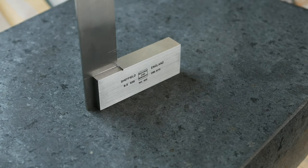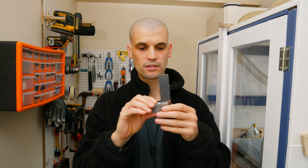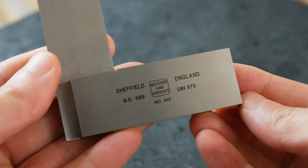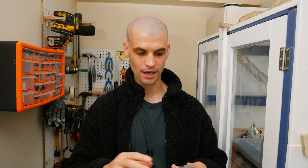Another useful item is an engineer square — a three-inch one. You do not need anything larger. All you're really checking is squareness, which just uses this little corner, and you can also use it as a reference edge to square stock in your vice. This is a Moore & Wright, made in Sheffield, England — it cost me £20 and it's a grade B. There are three grades: grade 00, grade 0, and grade B for workshop use. For machining in a utility room, grade B is all you need. Grade 00 and grade 0 are designed for climate-controlled rooms doing really tight tolerances you'll never need at home.